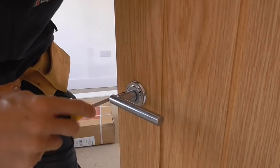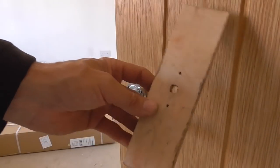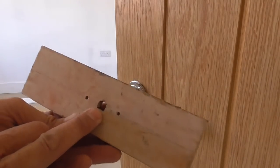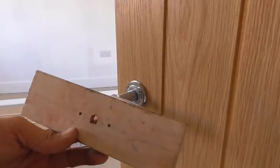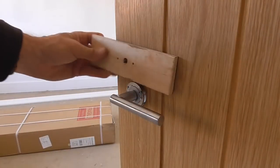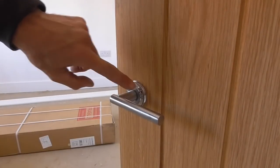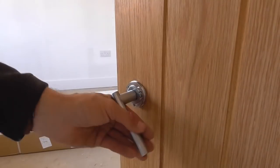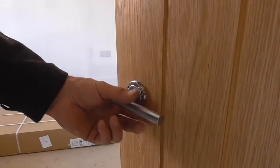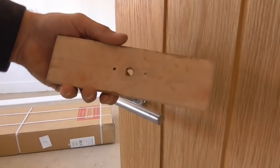There you go — just using this homemade jig. What it does is rather than measuring from the door to get the holes, you're measuring from the spindle, which is always going to be relative to the latch because it's going through the latch. So these are always going to be in the right place — just a simple little jig. It's getting a bit loose now; I might make another one soon. A bit of rubber on the back helps it grip on the door. I find it a really quick and easy way of fitting these bolt-through handles. All I've got to do now is put those anti-turn screws in — it'll be fine on its own, but if you've got children living there who might be swinging on the doors, it could slightly move them. So I've got the job done and another little jig. Carpenters are well known for making bits and bobs like this to help them on site. Anyway, thanks for watching.